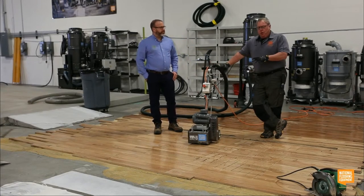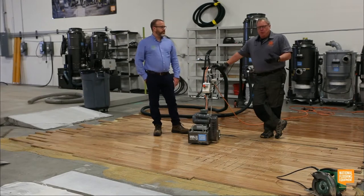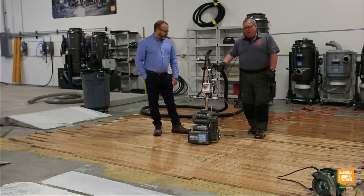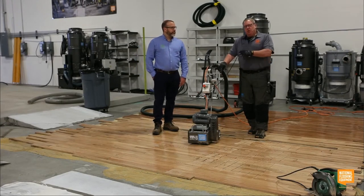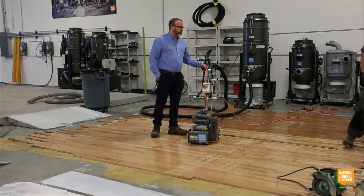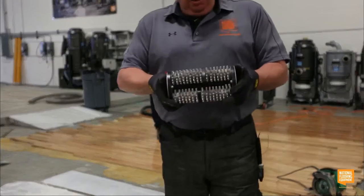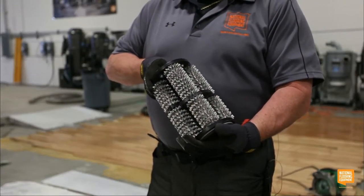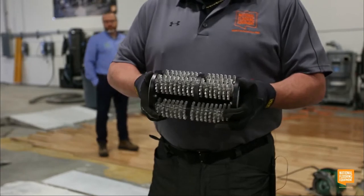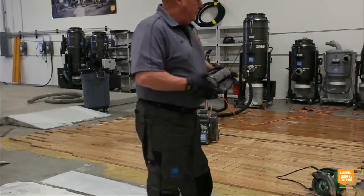Not only does scoring the hardwood increase your production and make things go faster, this isn't a very expensive tool — it's really well priced and it's 110 volts, so you can use it anywhere. But not only can I use it to score the wood floor, once we use a scraper to pull the bulk material off, I can actually change the drum. We can put on a drum with TSR-style teeth, and with the same tool use this drum to remove some or all of the glue. Two bolts, take the side plate off, slide this right on, put your two bolts back on, go right back to work.